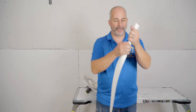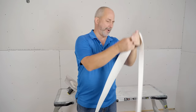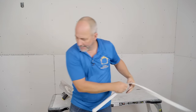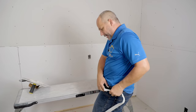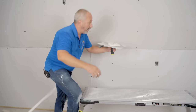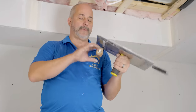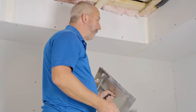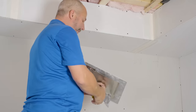Make sure you pre-crease it — you'd go through a crazy amount of work trying to do that on the ladder or bench while you're using the mud tools. Get this all creased up, stretch it out, and put it in your pocket — I like to throw it through my belt loop so I don't lose it. Have I showed you this yet? This is my new Hawkmate — it screws on with the regular handle so I can switch tools as I work. Consider getting one. It wasn't that expensive, and what a game changer when you're up here taping.